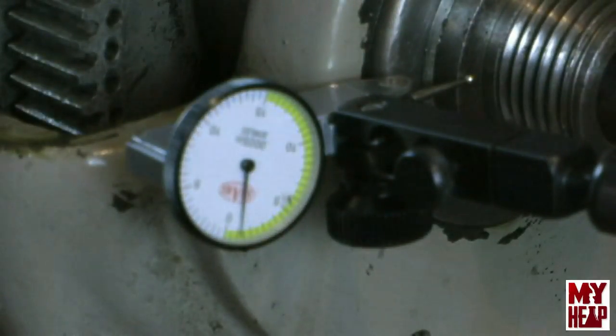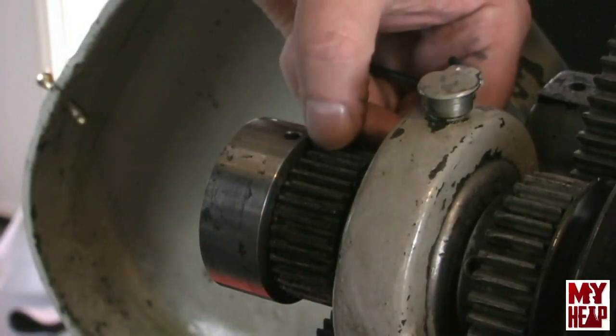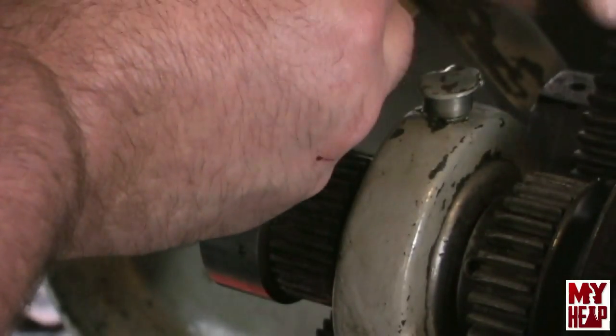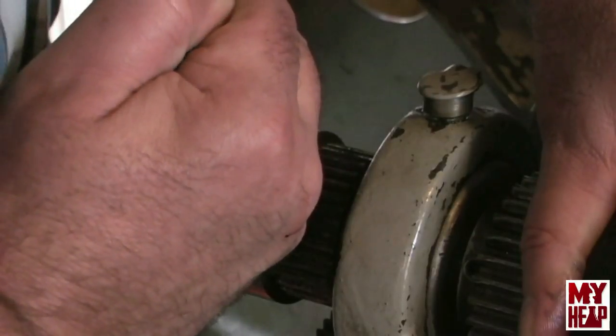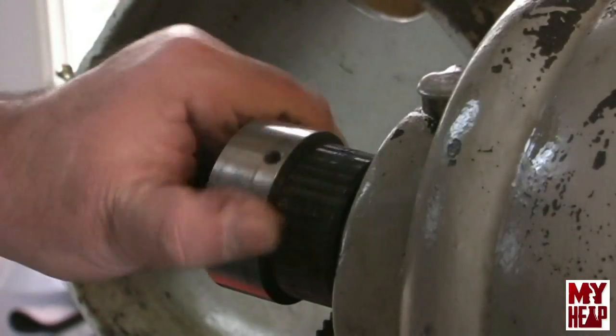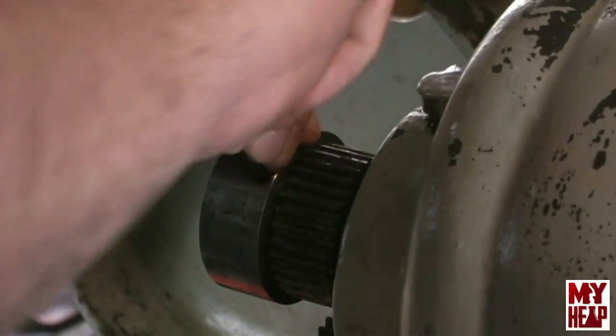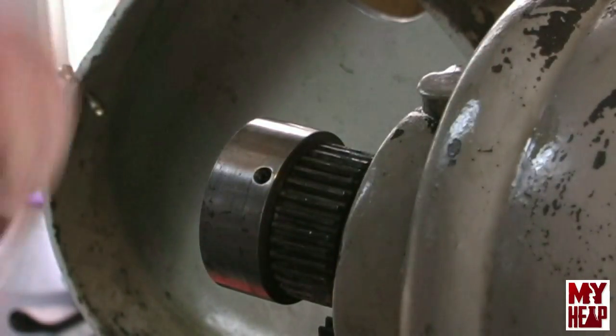Okay, that's pretty much gone. Now over here at the other end — I'll reposition the camera so you can see — I'm going to tighten this up two more teeth, or one-sixteenth of a turn, to preload the bearing. The collar is sitting right between these two teeth, and I'm going to move over two teeth. There we go. With the belt loose, I should feel a little drag, and I do. We can tighten this up and the end play has been adjusted.